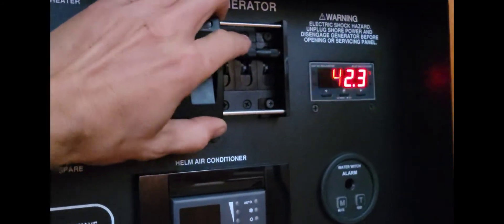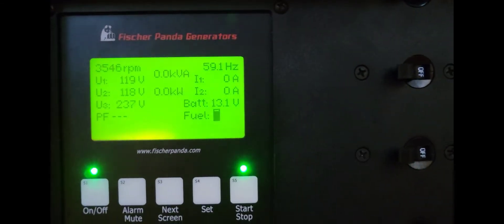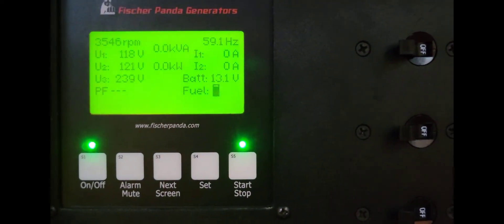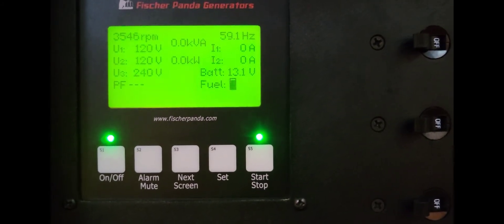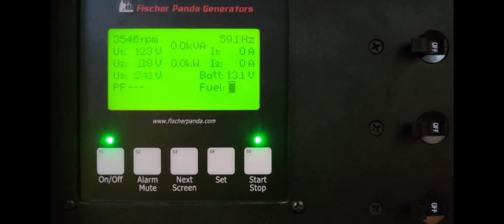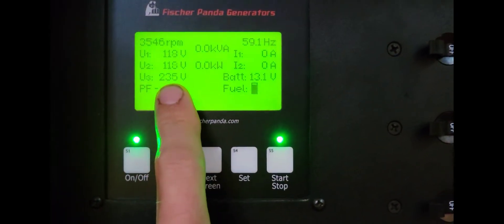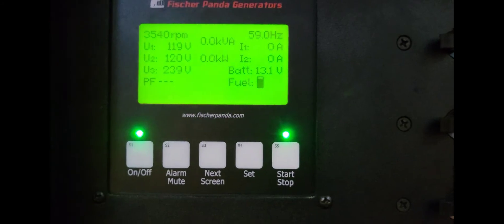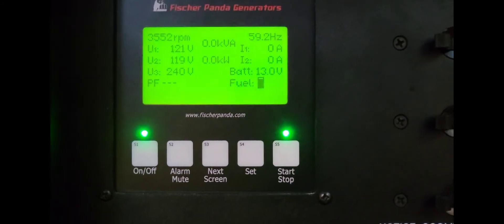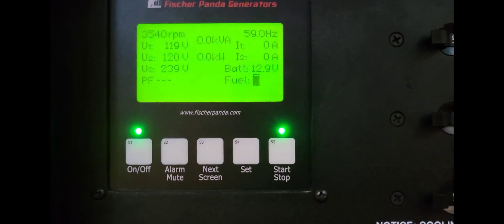When you go to turn this thing off, you want to unload it first — turn everything off, make sure it has zero amps being pulled from it. That way all the capacitors can get recharged and everything can be normal for the next start. If you turn it off with a load on it, sometimes it'll trick the computer into thinking it's still pulling a load, causing those boost capacitors to stay on. That will cause your voltage to be over 240 and your hertz to run closer to 65 instead of 60, and then you may have to replace the computer or a capacitor.